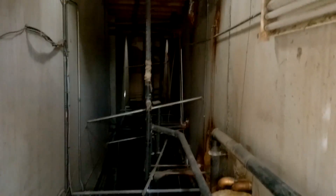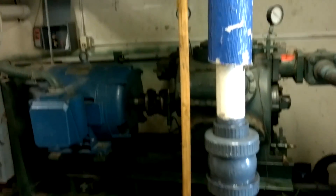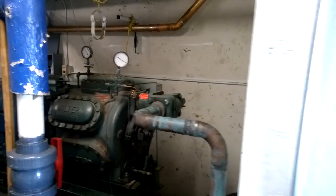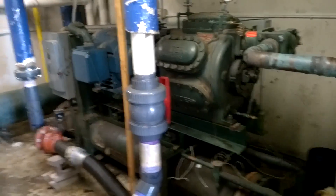This whole platform's moving — it's pretty scary. Who knows what's holding this sucker up. This is basically looking down in the pit down there. There's a recirc pump that pulls the water from the return from the whole wing down into the pump, lines up over the old dinosaur chiller there, and goes into that boiler room right there. There are no air bleeds or anything like that, no PRV valves — just off city pressure for that. This will be replaced with some new stuff here pretty quick.